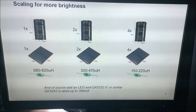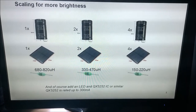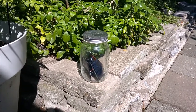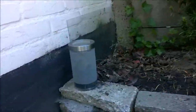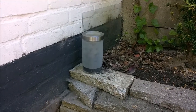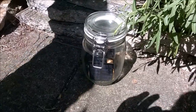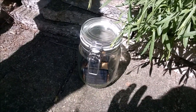You need the IC and LED as well to create the light. These spots get hot in summer — 50°C is no exception — which is also why we use the capacitor at 2.2 volts instead of its rated 2.7 volts and sacrifice some capacitance. But they also charge in shadow: this light is pretty much in shadow all day and it works fine every evening. Remember that the solar cell is way oversized compared to other solar lights you buy in cheap stores. You can put your electronics inside the spots, but keep in mind that moisture can be trapped inside and sometimes you have to open them to release it.